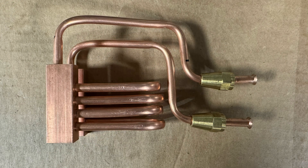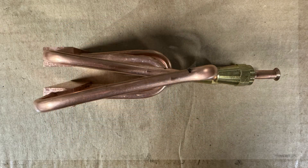But in thinking about it, I believe what's going on is if you have, say, one amp of current entering the manifold, each of the coils only gets a quarter amp of current, so the magnetic field is much weaker than it might ordinarily be.